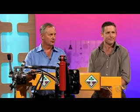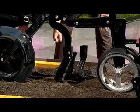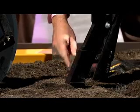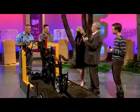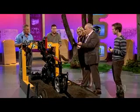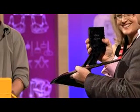The interesting thing here is that you've taken an 1870 invention, the stump jump, and you've suddenly improved it, which is fantastic. But you've also got three elements here which you can put on one machine quite easily. You've already talked about the seeding, which you've got the seeder and you've got a boot here for seed. You have another boot for fertiliser? Yes, you can put another boot behind that for fertiliser, either liquid fertiliser or solid fertiliser. And Richard, this gadget here, you just fit that onto the same spot as you did have your boot before. That's right. And all of a sudden, you're now doing a cultivator on the same expensive piece of machinery.